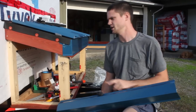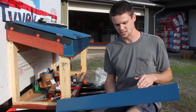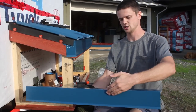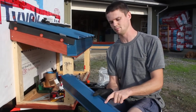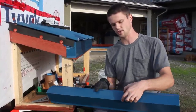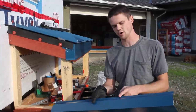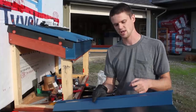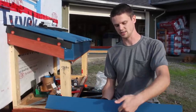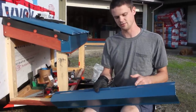All right, so I made the mark that lines up with the front of the panels, and the way that we're folding it is such that I want a piece of this section to fold over and basically meet up with this line. So the width of this section is 2.5 inches. So I'm gonna go from my mark, go 2.5 inches out, make another mark, cut the whole thing, and then I'm gonna make little snips so that I can fold it. So the first step is gonna be to go 2.5 inches and make a mark.